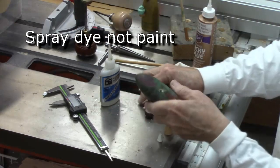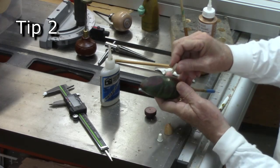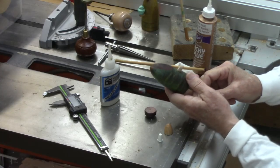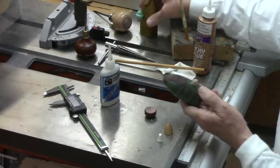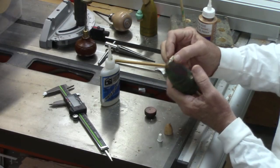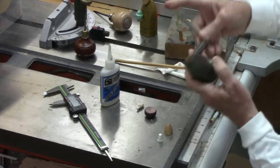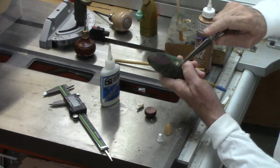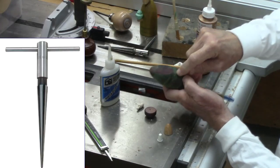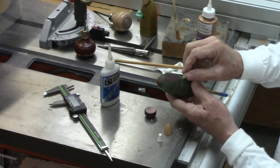Tip number two: I've got to put these little hands in there and they're each going to have a little present like this. When drilling these holes and sizing them, sometimes I'm off a little bit. So if the hole needs to be a little larger — I've shown this tip before — use a plumber's reamer and it works out great. It also clears some of the chips around the edge from the drilling, and that goes in there just like that.